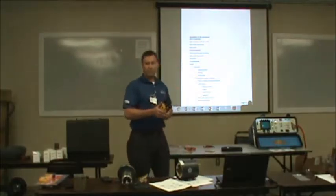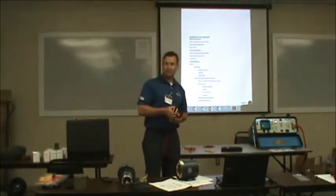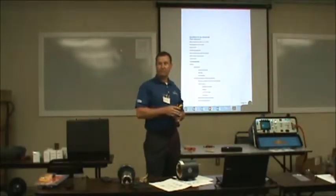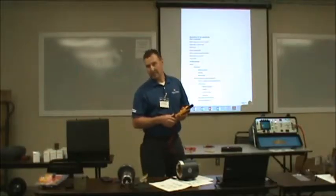You've got digital reading of how many hertz your pump's running and how many amps it's pulling. Good to have that in the back of your head or wrote down somewhere so you know what the normal operation is. So if you've got a clog, you know what's going on.